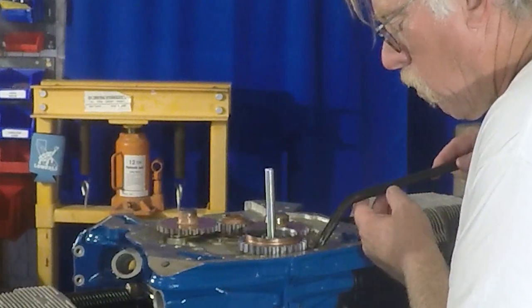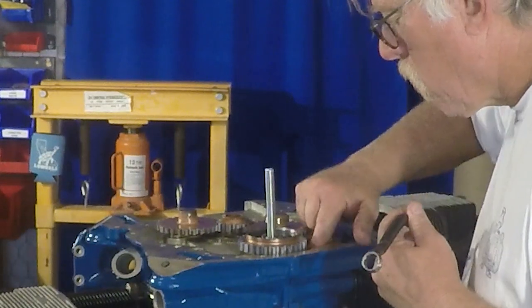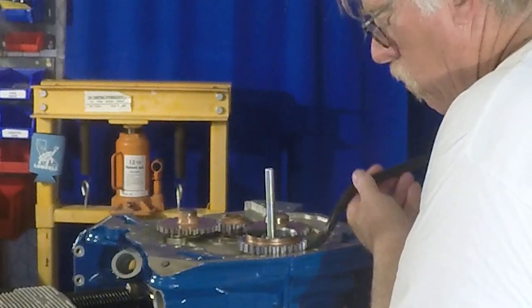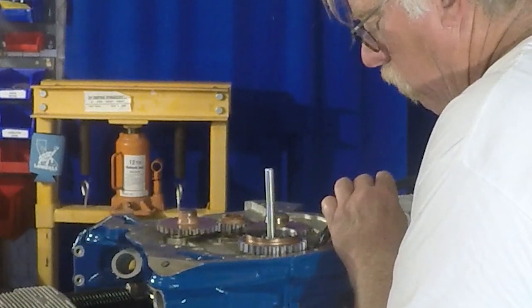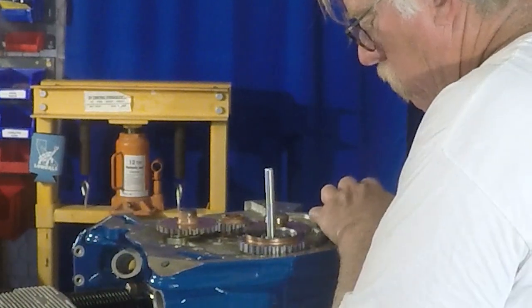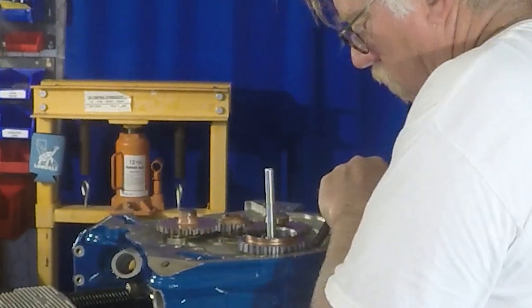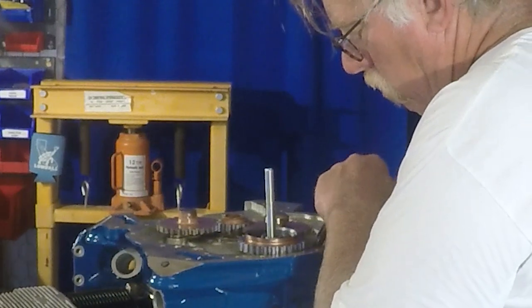Now, if you have a brand new set of cylinder wrenches, you may have to polish and grind on your cylinder wrench to get in there. This is actually the second set of wrenches I've had. My first set ended up cracking. Why did it crack? Because through some of the years, you've had to polish some of the areas to get them to fit just right on a Lycoming or Continental cylinder, and do things like this.